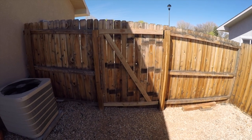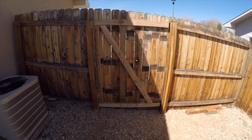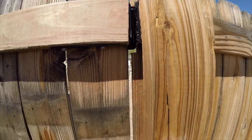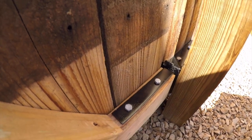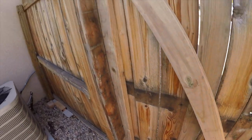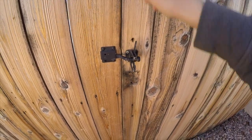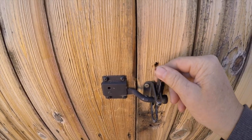Here's my finished gate project — well, 99%. Still got to find a coat hanger to make a latch pull. It came out real nice. I want to show you some close-ups on these hinges so you can see how they're put on there. They work really well. Here's a look at the bottom one. These are inch-and-a-half lag bolts that are hot-dipped galvanized. I've got a 2x4 on the inside of the gate to keep it from pushing inward. I've got a hole drilled here but I need to make a piece of wire to connect to that latch so I can pull it from the inside.